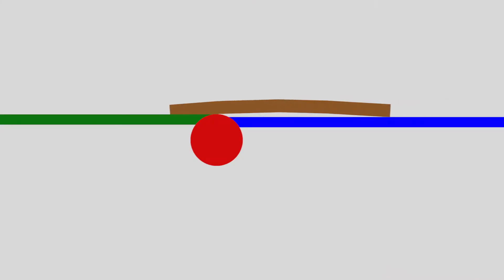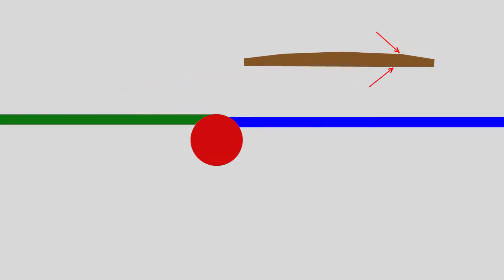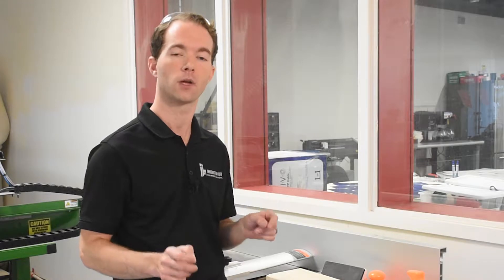With the crown up, it's going to take off this little bit in front, and then this little bit here in the back. Then on the second pass, it'll take off a bit more, and so on, until the bottom of the piece is flat. Now if your piece is really bowed, you'll have to cut it up into smaller pieces first to avoid turning most of your wood into hamster bedding. If you don't do it with the crown up, your piece can rock on you, and then it's impossible to hold down flat, and you're not going to get a large flat surface. It's also removing the useful part of your wood, which isn't good. So crown up, always.